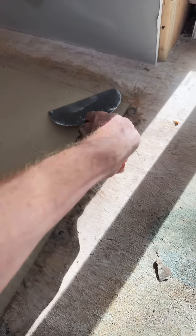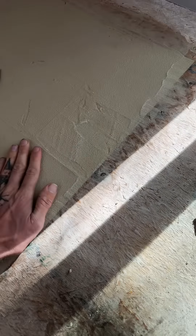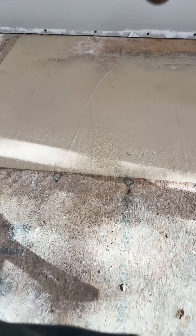Wasn't sure if the floor patch was going to dry last night, but it certainly did. I'm just knocking off the high spots — future me will highly regret using my drywall tool to do so. Before flooring, I always take a straight edge along and make sure there's nothing sticking up, and if something is sticking up, it needs to either be removed or pounded down.